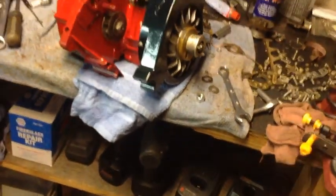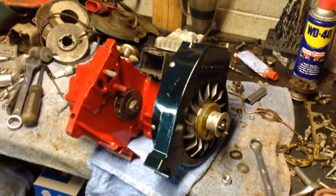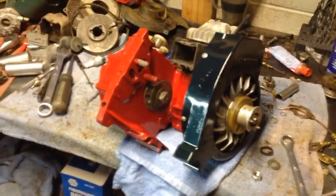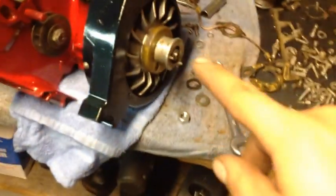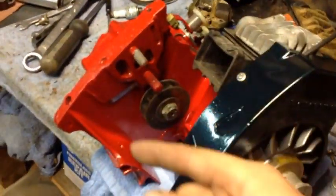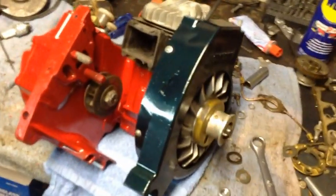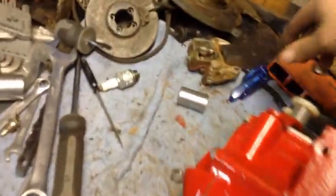I think I can finally show you the cylinder. You know the funny thing about these saws? This particular saw runs backwards. I don't think I ever got to tell you guys this until now. This saw runs in reverse from the rest of the saws out there. So like this saw here — it's a direct drive — it runs counterclockwise. But this saw here runs clockwise. It's because the clutch turns this way, which turns the gears this way. So this is a saw that runs in reverse like a diesel, but it's a gas engine. I just thought that was so cool.